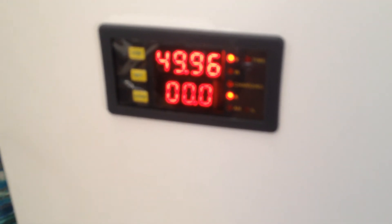Now that's pretty much steady on almost 50 volts according to that — I've still not calibrated it. So I can take this off, remove all this, and safely put the fuse in place. It requires a bit of effort to get it in; these are quite tight — I usually do it with a mallet. But you can see, there we go: 50 volts there and down here with my meter probe on there, 49.8. So as you can see, there's a little bit of calibration required still. That's how we prime, or pre-charge, those capacitors safely without any arc welding.